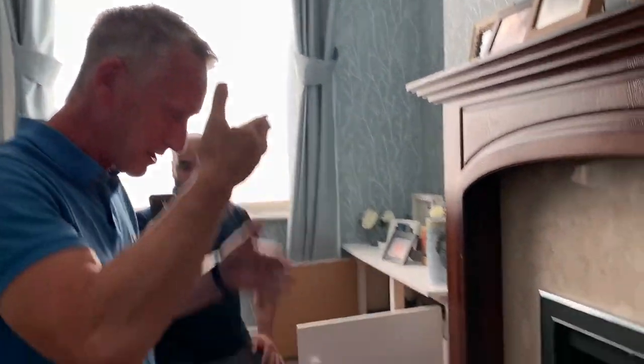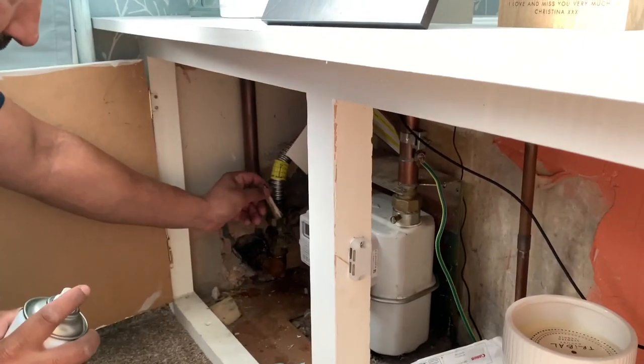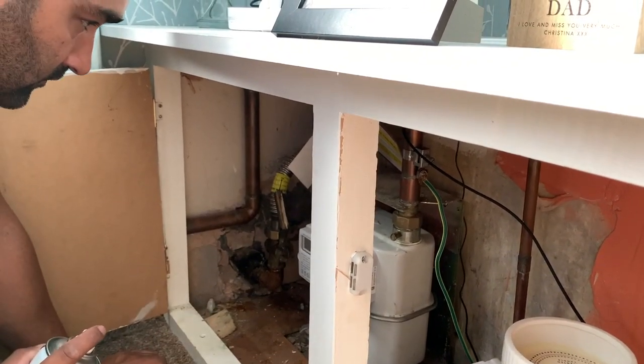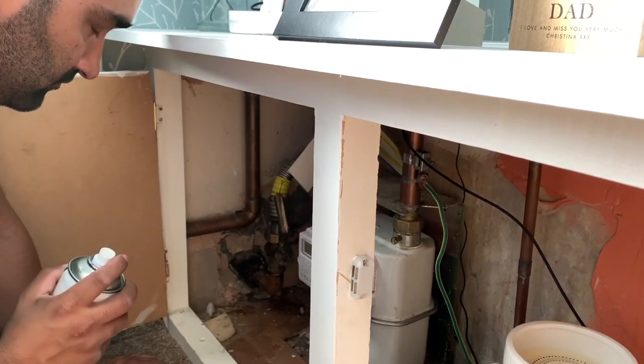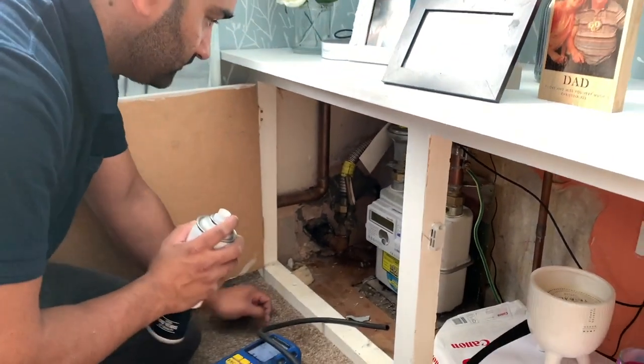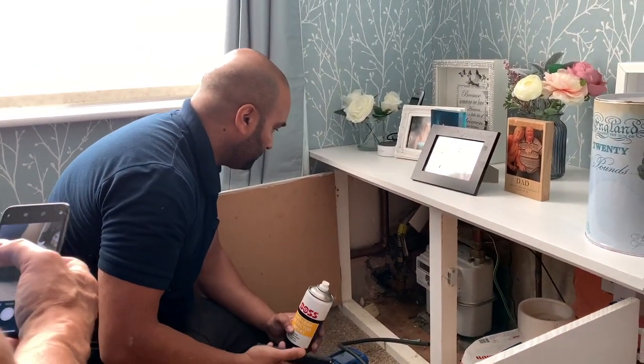We've had the door shut and we've got the window shut, so it's pretty warm in here now. Disconnected the analyzer now. Mo's turning the gas on and now he's going to spray the test nipple with LDF to make sure we've no leaks. That's good. Happy? Yep, happy.